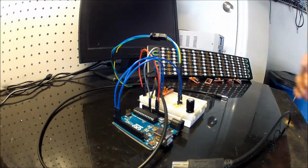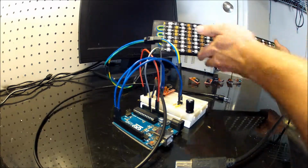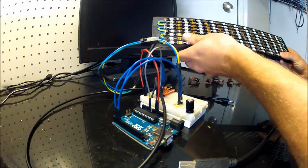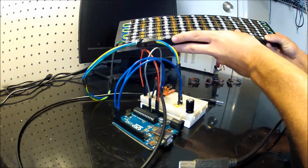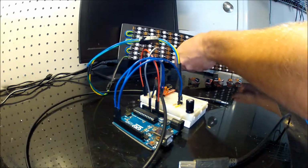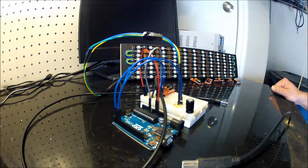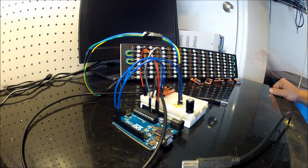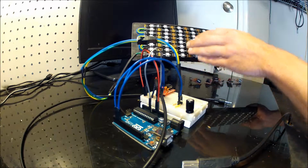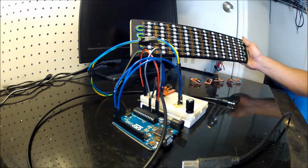So what we have here is the same setup as before, except that we've connected a homemade WS2812B, also known as NeoPixel matrix, to it. And basically we've added a couple of libraries and functions that do some different things than our original program. First, we've included the NeoPixel GFX and Neo Matrix libraries, which are available from Adafruit. Additionally, since this has 11 channels, I've also averaged some of the channels out. So for example, our third channel is actually an average between channel 1 and channel 2.